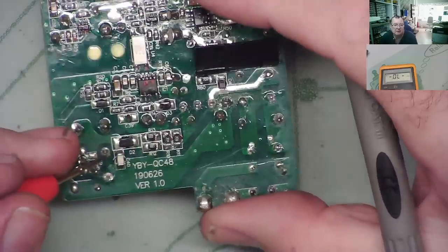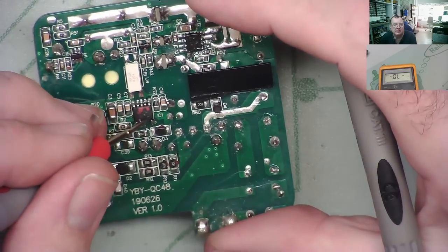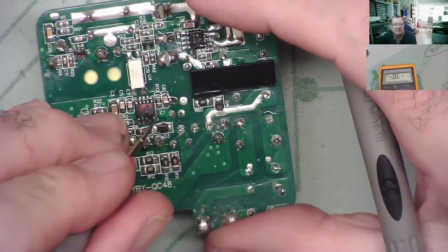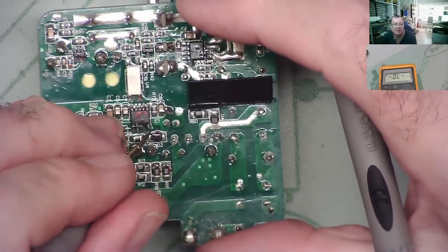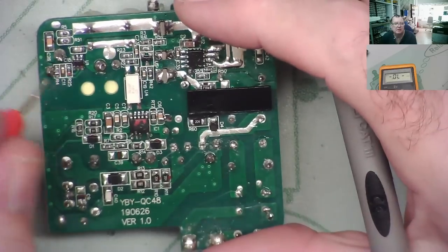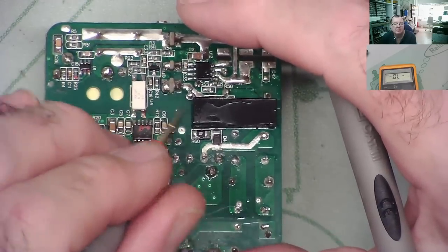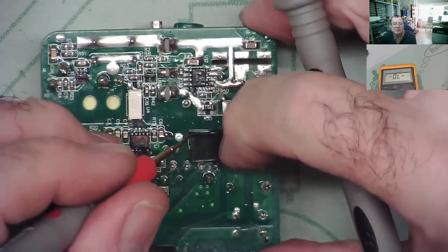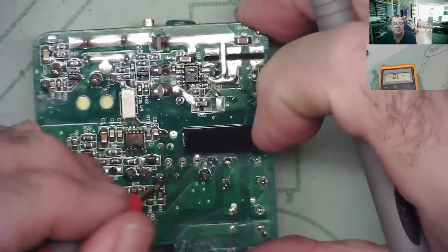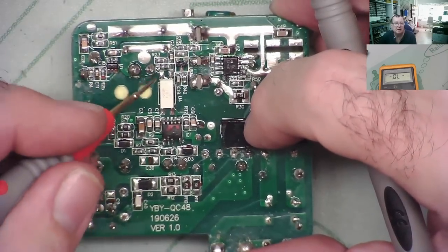Yeah. So I can see a chip here. This, where there's a pin missing, the one the other side of the gap, and that pin is deliberately missing, will be the high voltage pin. Okay, you can also see there's kind of a gap which runs through here. This is the opto isolator. This will be, well, it's just a little bit of plastic actually. But this will be the transformer somewhere. Yeah, transformer's there actually. Yes, the transformer's here, and this will be the output from the transformer.